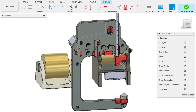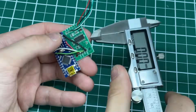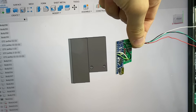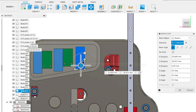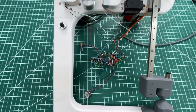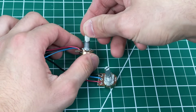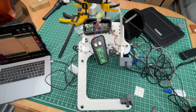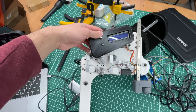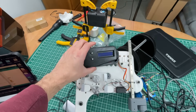We're all done with the software, so to wrap up we just need to make an enclosure for the electronics. Once the general design is done we digitize the electronics to make sure they fit in our small cavity — it turned out perfectly for our purpose. We played around with the layout to ensure everything fits and then 3D printed our electronics box. I also added potentiometers to the Arduinos which will enable us to adjust the tension controls. These are mounted with an LCD screen onto the front panel, although I'm not going to configure the LCD readouts until our final version of the wire EDM.